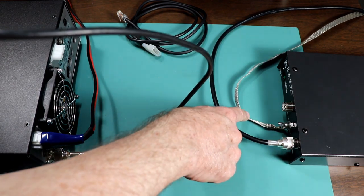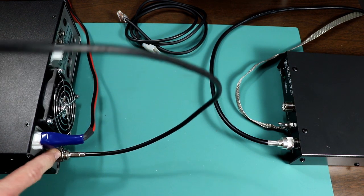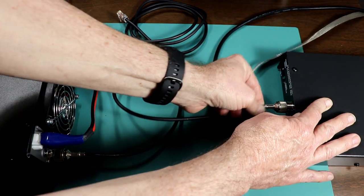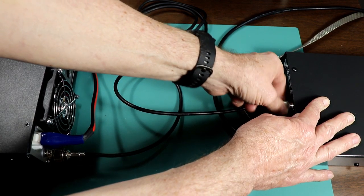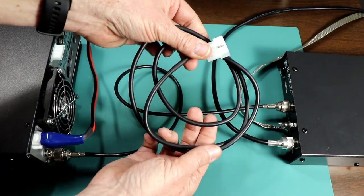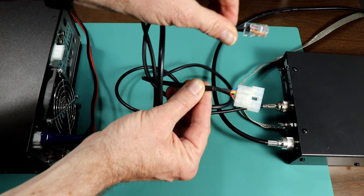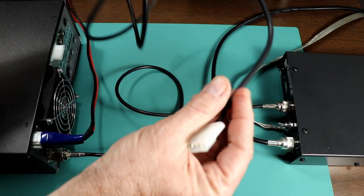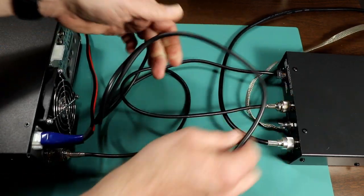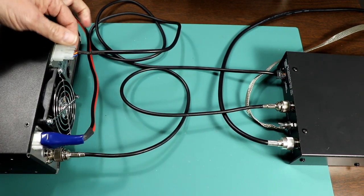I've already got the antenna connected to the tuner and the ground strap connected to the tuner. We'll connect a ground strap up to the radio before we finish doing all the connections and powering up. The coax gets connected to the transmitter input on the antenna tuner, and that gives you your RF between the radio and the tuner. The other connection you need is a cable from the tuner connector to the ICOM external antenna tuner connector for tuner control. Each tuner comes with a cable that has appropriate matching connectors — you simply plug the appropriate connector into the tuner end and then plug the other connector into the radio, and that's pretty much it.